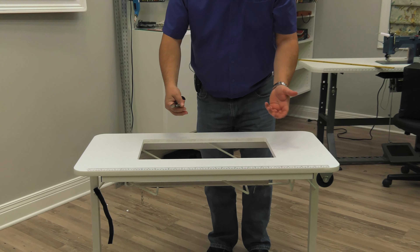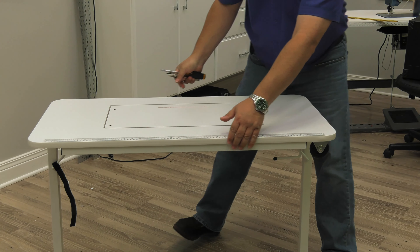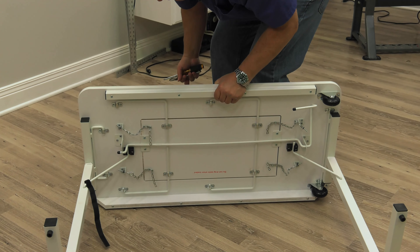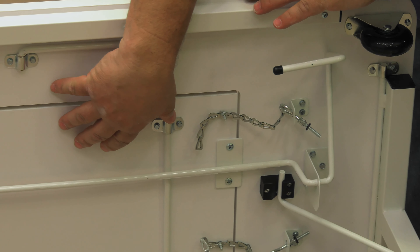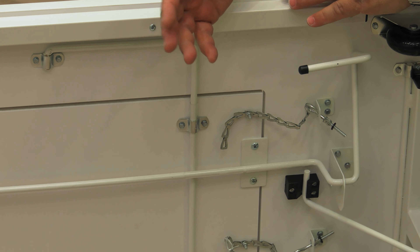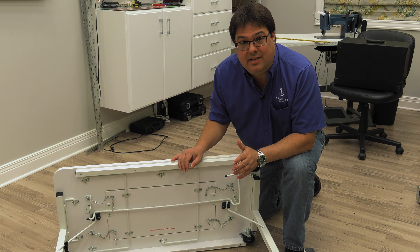For this purpose we're going to turn it on its side so we can see it better for the video. Before I do that I want to raise the shelf, and then I'm going to flip it on its side. Now we can see the chains down below. Since we have this shelf perfectly level right now at the three and five-eighths inch depth, I know I want to go to about four and an eighth to four and a quarter, which means I need to lower the shelf by roughly just under five-eighths inch.